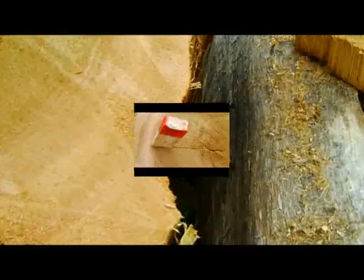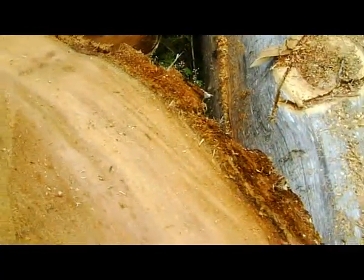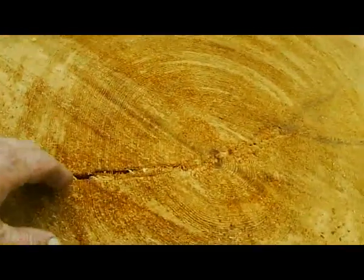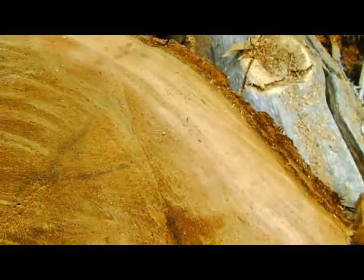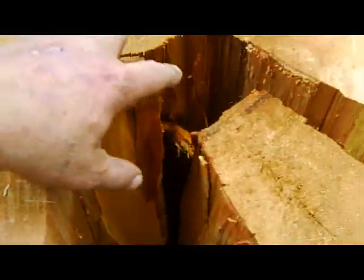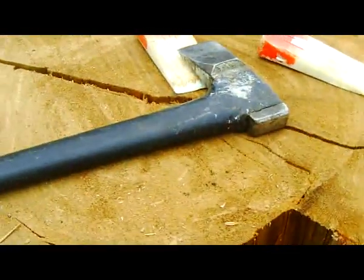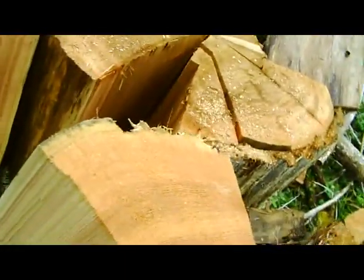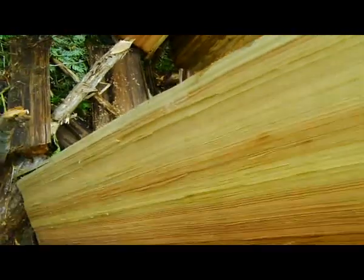For the sides — when you look at a round, you always look for the crack. Every tree on the ground has a crack. What that tells you is that where that crack is, there are no knots, because that's where it cracked when it hit the ground. So we've got the wedge in and we're going to try to open her up. I've cut a chunk out of here because there was obviously a little problem there, so I'm not going to get any harp guitars out of that. The chunk I got, as you can see, has no runout — straight up and down.